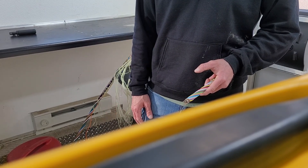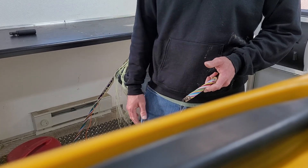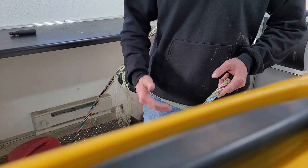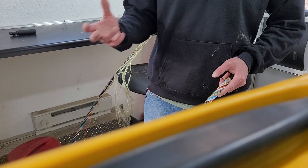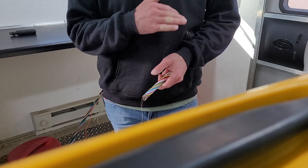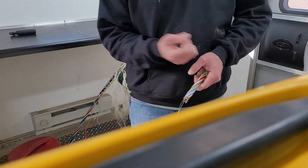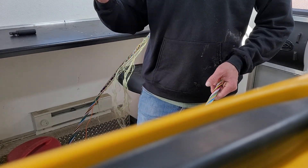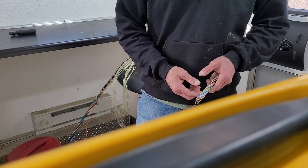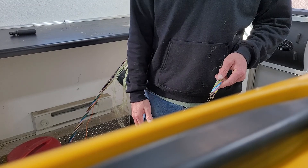Maybe underground, maybe around water — a lot of conditions that aren't beneficial to that cable. That $1,000 tool works great, and I personally believe that's because it's solid metal. It does not give as much as the plastic tools that are also expensive but much cheaper. I believe plastic bends and doesn't keep the cut straight. Whenever the tube gets really rigid from hot-cold cycling, it just shatters the tube instead of cutting through it. A hard, rigid metal tool is not going to give — it's going to keep slicing regardless of how tough the tube gets. Plastic buckles whenever it hits that rigid hard tube.